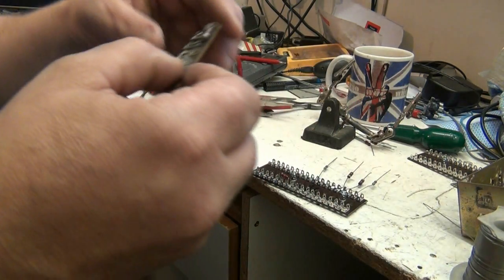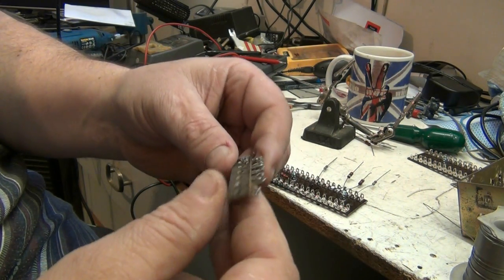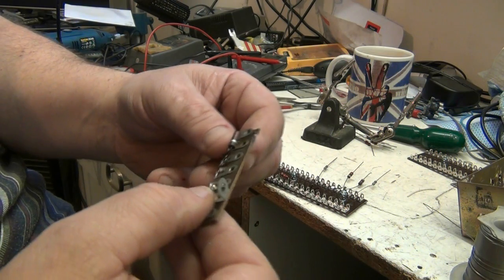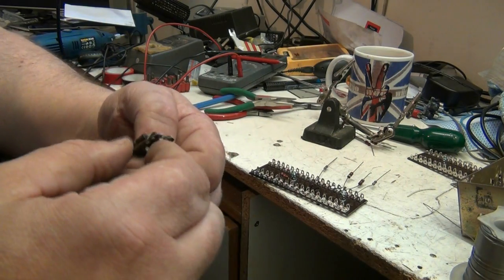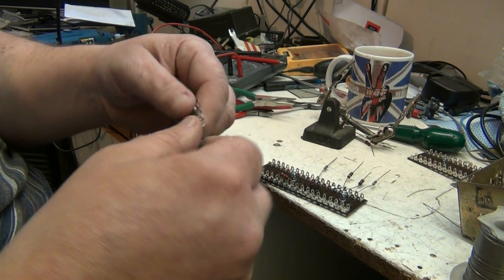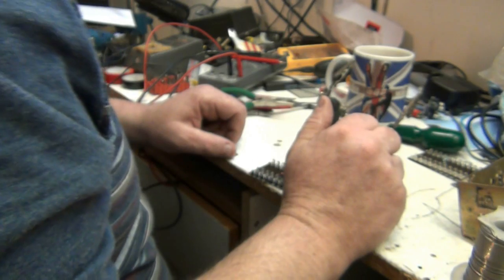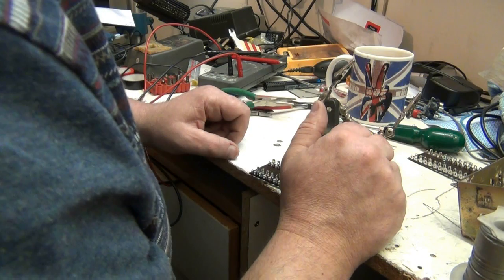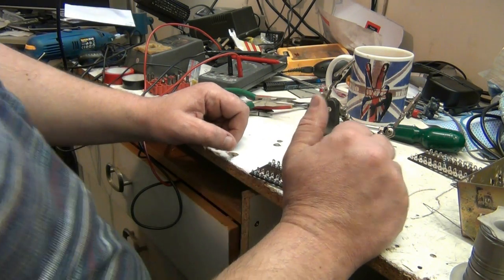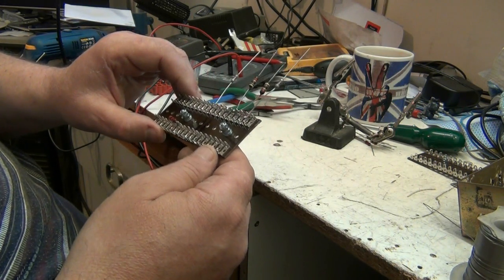I need to drill the holes in the chassis for this and the other one, and I need to work out how I'm going to take these resistors across. I have got some original single tag boards from the original amplifier - there's even a resistor soldered to that one. But I've still got these, and I drilled these out carefully. So in the event I have to, I can reuse them. I've got three or four of these. All I have to do is count the rivet holes and have a look for the tag boards. But that's where we're at now folks.